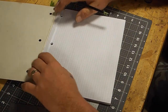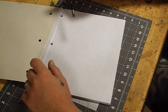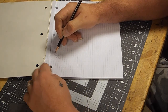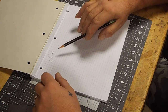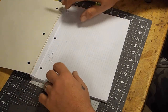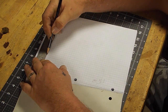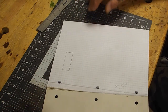First thing I'm going to think about is any other molding that's up there that's going to stay. The molding that's up there now on the doors and windows is 2 1/4 inches wide. If I make my molding anything other than 2 1/4 inches wide, I'm going to have to modify the base mold and the quarter round. I don't want to have to do that. I'm going to draw out a blank cross section 2 1/4 inches wide. Alright, so that's the cross section of the blank for our molding.